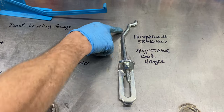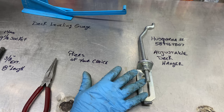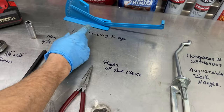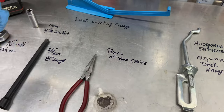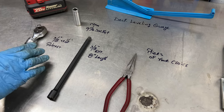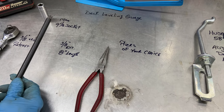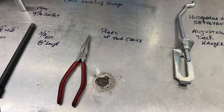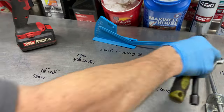This bracket is adjustable — I'll put a link in the description below. The part number is 589-464-807 if you want to order it from wherever. It's called a deck level and gauge. I'm going to show you the big difference in how high the mower deck sits now versus after we put this on. You'll need a 14-millimeter or 9/16 socket — they're pretty close to the same size — to take the nut off, and a 3/8 ratchet or bigger because that nut is a lock nut and can be pretty hard. That's why I'm going to use my electric drill with an 8-inch extension to make it accessible without putting your ratchet inside the wheel well.